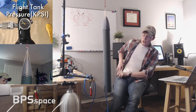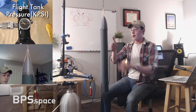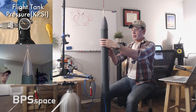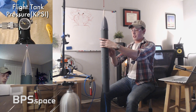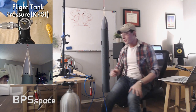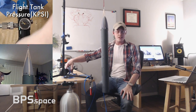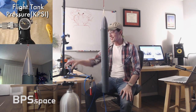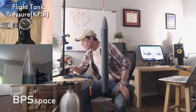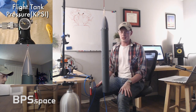Okay. So the new plan, by the way, let me make sure this is correct. Right-hand rule, this is up, which means positive 90 degrees. It will start at this orientation, and then we will go ahead and roll 90. That's the plan. We're just going to roll 90, and then it's going to hold 90. That's how this should work, in theory. I'm a little worried about our air pressure, so we're just going to keep testing until we can't realistically test that much anymore. I think as soon as we drop below a certain value, it'll just be futile, and I'll have to go repressurize the tank, which takes several hours.